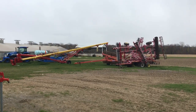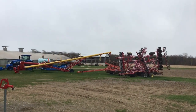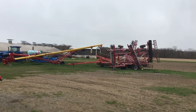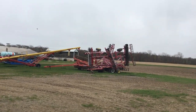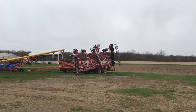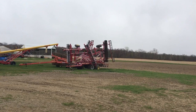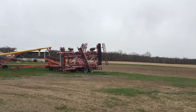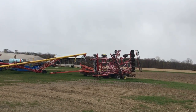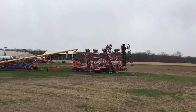There are our two 10-inch augers — one is for wet corn, one is for dry. We've got a set of 30-foot packers that we sometimes run on the back of the cultivator or on that sunflower, which is a vertical tillage unit. Depending on our conditions, it is handy. We do no-till, but we also do till — there is a need for it. It's all about your soil conditions and what you had to deal with that year. On a wet year, we've had to work some ruts.